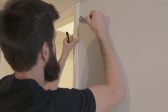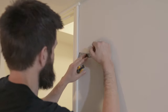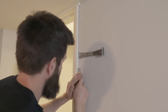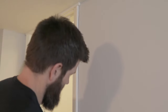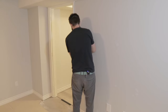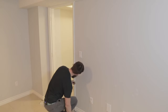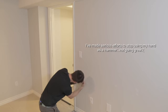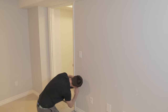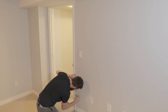Just work it slowly along. See, it's still attached a little bit right down here — you want to be careful because it will pull the paper away very quickly. So you're just slowly working the casing off and being careful that the dap is not attached. Looks like it's fairly good here, might be a little bit right at the bottom. Once you've got that off, you can be a little more aggressive with the casing — just get the thing off of there.